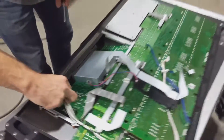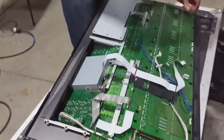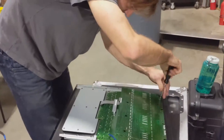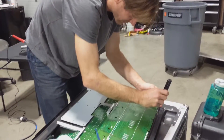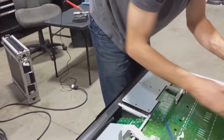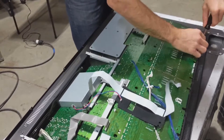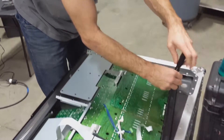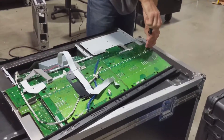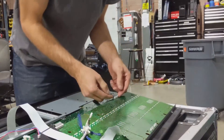Here's the tough part — the faders. Well, it's the meticulous annoying part. Are you changing all of them? They're all bad anyway. This is a full refresh folks. As long as all these components still work, they'll likely keep working — the only thing that goes bad is the moving part, the faders. You gotta take off all those boards to get to them — but it's just eight screws and the thing picks up. You gotta know how to do things like this.